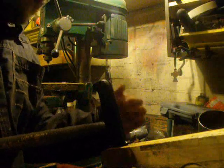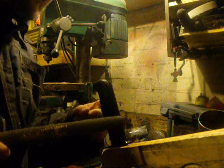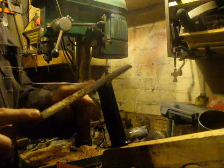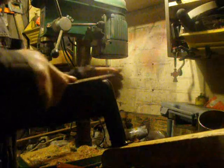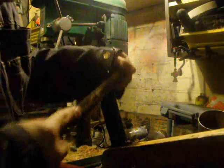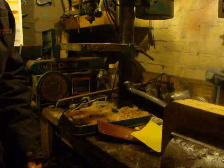Now, if I worked on that side, I'd tear the wood really bad, and end up losing wood as it peels off on the face of the scales, which is not what I want. I don't want it to start peeling off this way. So I'm literally just working on the side where I am, like that with this rasp. And just as I touch the metal, that's when I back off. Like that. I'll see in a bit when I've gone all the way around both sides.